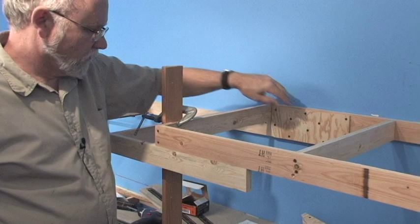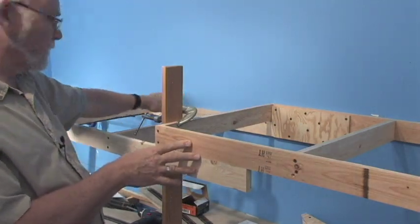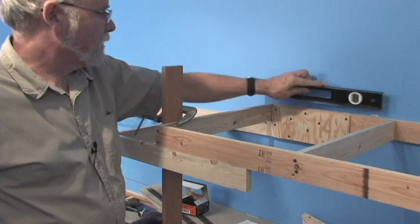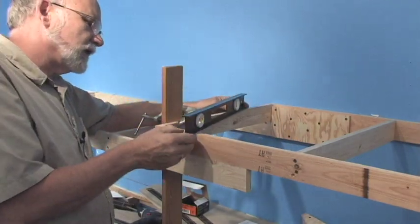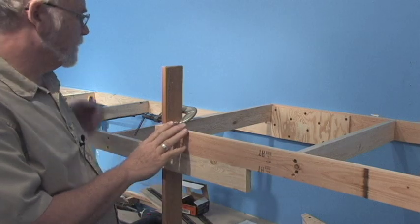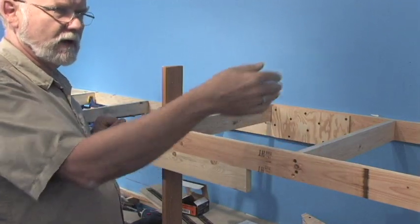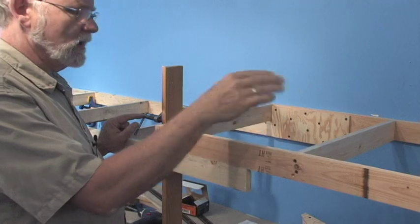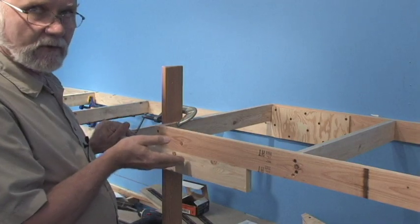The gussets are now installed on both sides — this is nice and strong and we've taken the clamps off. It's not screwed to the wall yet, nor is it fastened permanently; we still have the temporary support here. The back is verified good with the levels on both components. The front edge has to come up a little bit, but since the back is okay on the wall and both ends are properly positioned relative to the upper deck, I'm going to go ahead and screw this portion to the upper deck, the back wall, and the other end, then make the final adjustments on the front.